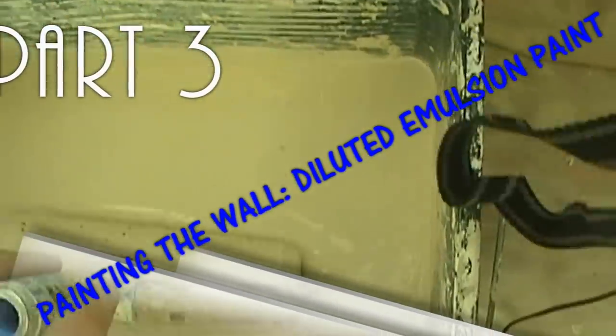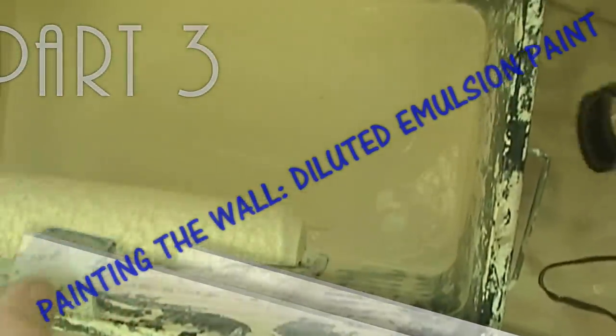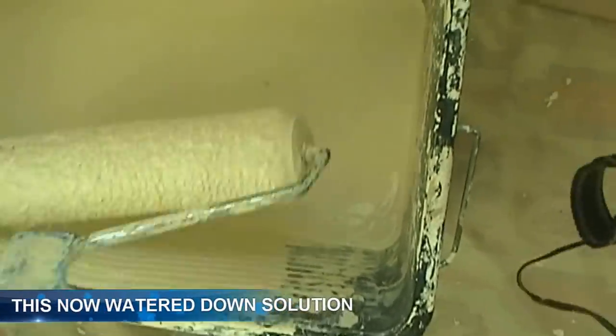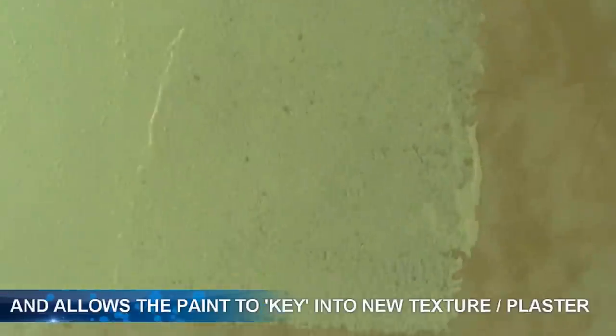Load the roller up. Whenever you load the roller up, don't get the roller right in and get all the metal and everything wet. Just prime the edge, the fluffy edge of the roller. And then we'll commence rolling. Right, if you look carefully now, you can see little lines and roller marks, little splashes. The idea is to just crisscross it nice and gently. And what you're trying to do is take those little marks out of the paint so it's all nice and smooth and flat.